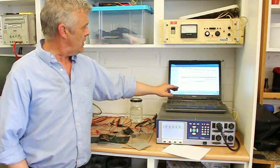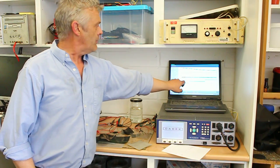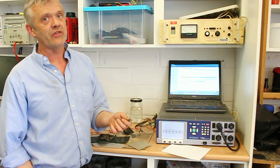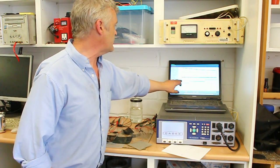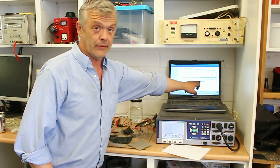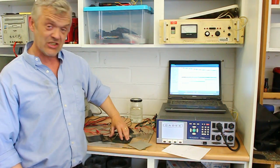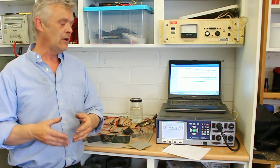Now, the percentage figures that you can see here, it says capacity in percentage, are read as a percentage of that 150 milliamp hours. So this bit here, when it reaches the 1, that's 1% of the capacity, representing 1.5 milliamp hours that it's actually discharged at a rate of 30 milliamps. And as you can see from here, which incidentally is this one, that reached nearly 3%, actually about 7 minutes. And we can see here is the actual load that was applied, which is 30 milliamps, and we can see the shape of the graph on its discharge there. And you can see it's relatively capacitive. It's got what you'd expect of a capacitive discharge, because it is essentially old tyres in a symmetric capacitive relationship, so you'd expect to see that kind of thing.